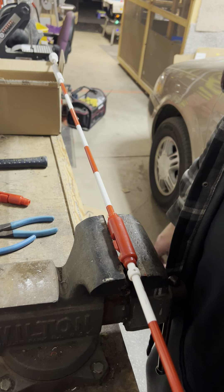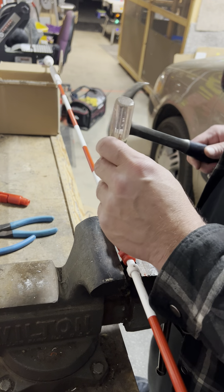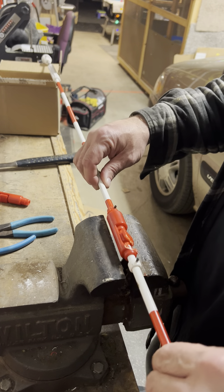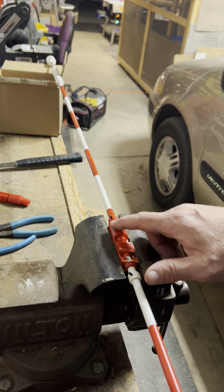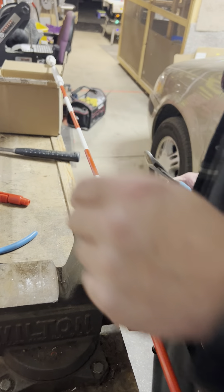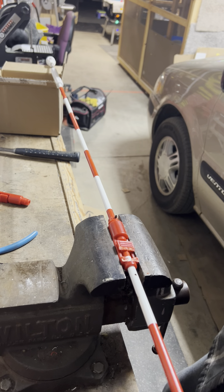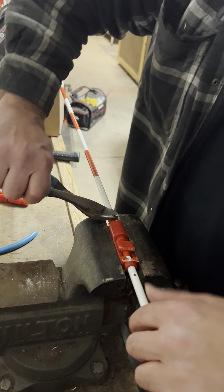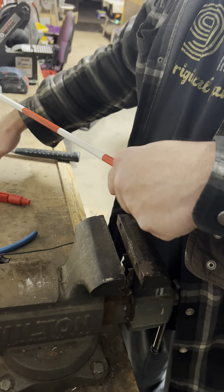What I used is this little Torx bit — it fit in the hole perfectly. I just put it on top here and gave it a little tap, tap, tap, and the same thing on the other one. I already pre-tapped them a little bit. You can see how the pins are sticking up now. Make sure you have some sort of tray, because when you take these pins out you don't want to lose them. I use side cutters here to grab and rock, pry them up. Then this little white knob comes off.